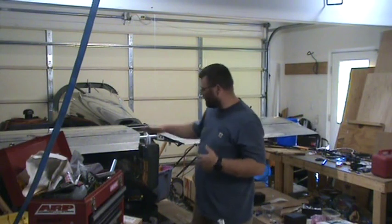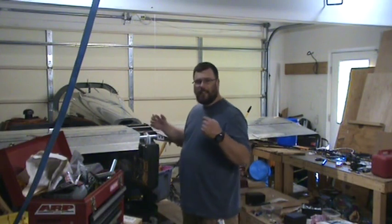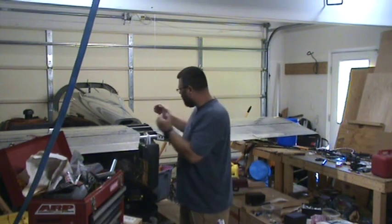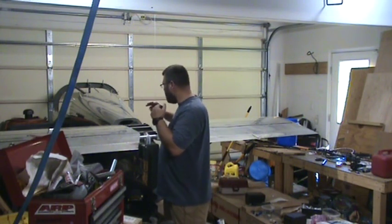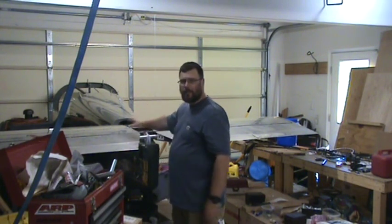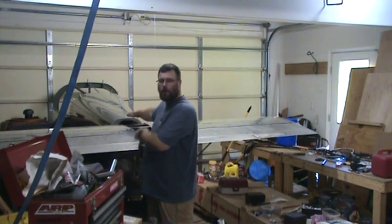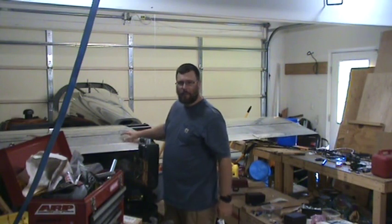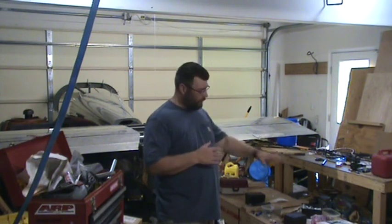And most of my trouble was getting this side to run down to match the right side, because the external sleeve of the cable was stopping the internal portion from moving far enough forward. And so I had to shift the outside of the cable sleeve forward by adjusting the hard mount points. Basically, instead of it being screwed halfway, it is almost all the way forward in this front bracket and almost all the way out on this aft bracket that's mounted to the cover plate. And I'll go over that in a separate video using pictures and a mouse showing exactly how it's set up.